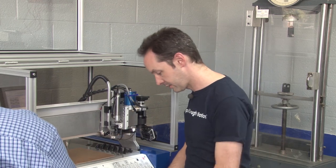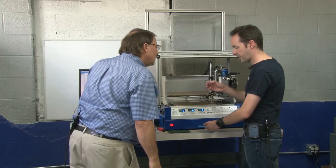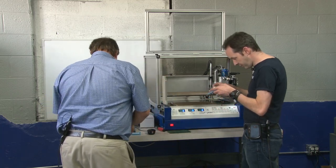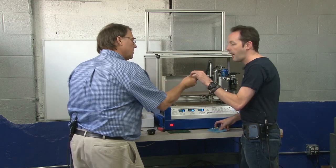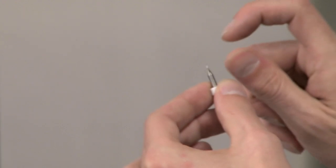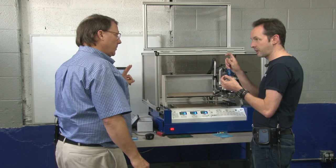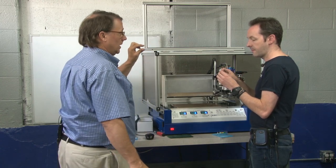What do you want next? It's asking for the 032 end mill. Okay, I've got that. That's a drill bit. When they're that tiny, it's really hard to tell the difference. Notice the difference — the end mills are way short, whereas the drill bits are really long. Two flute carbide tools with a stubby length.